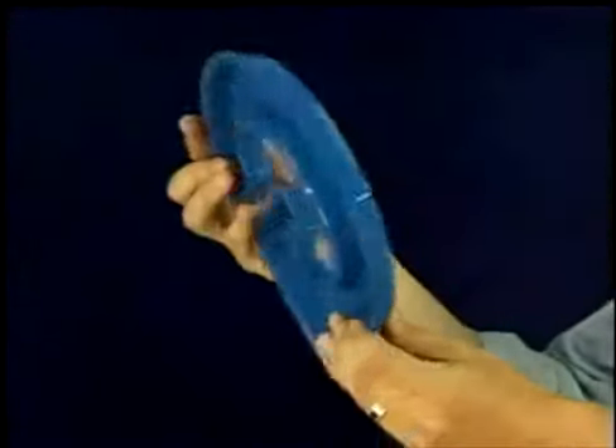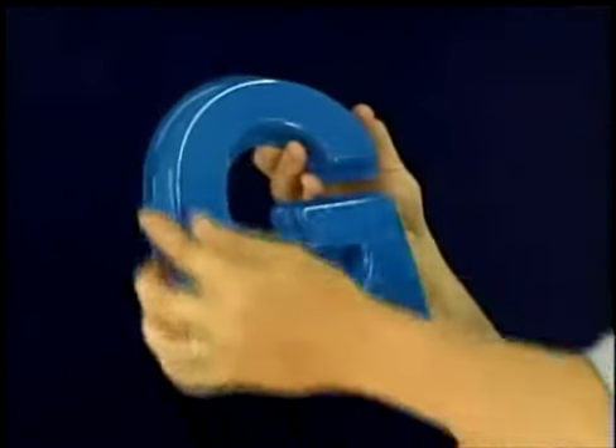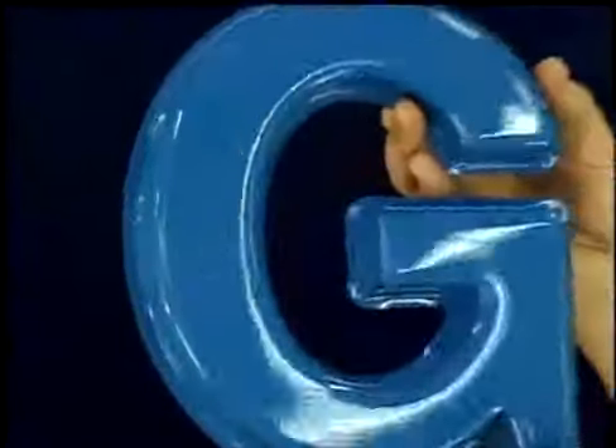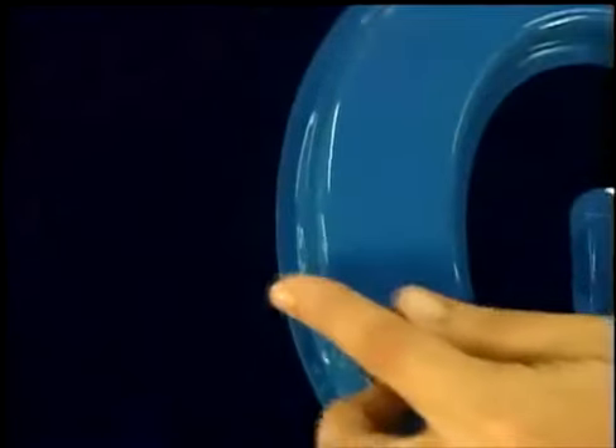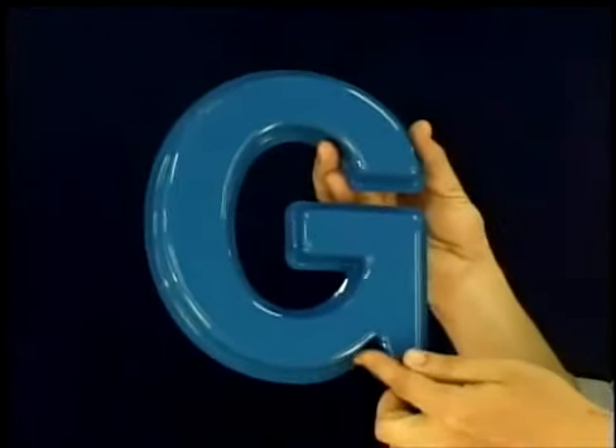Flange mount on small letters greatly distracts from the style. The typical flange is around one quarter of an inch. Letters over 30 inches high would have a one half inch flange. Special size flanges can be requested.